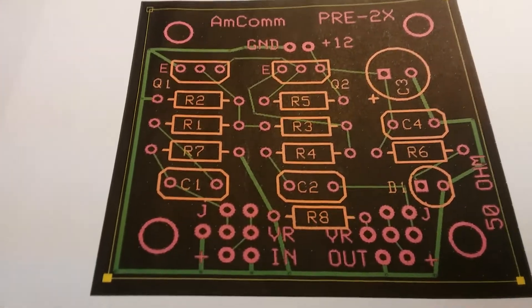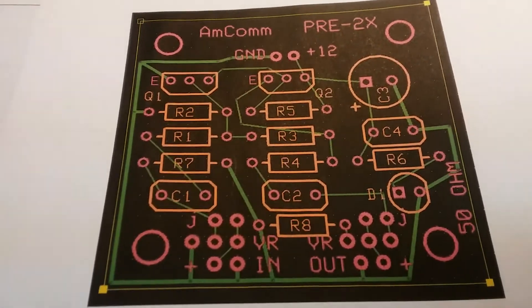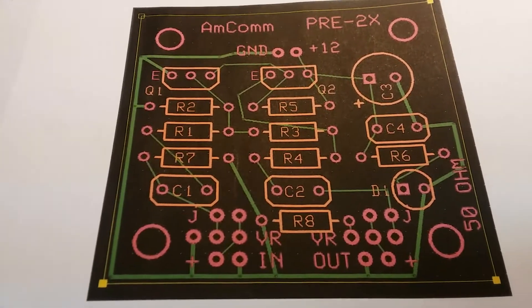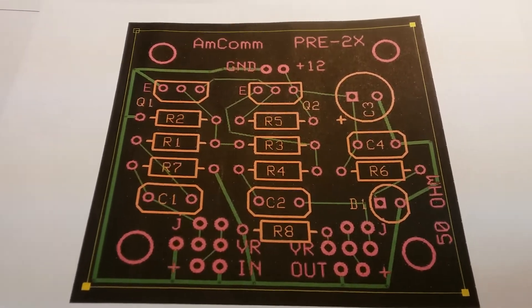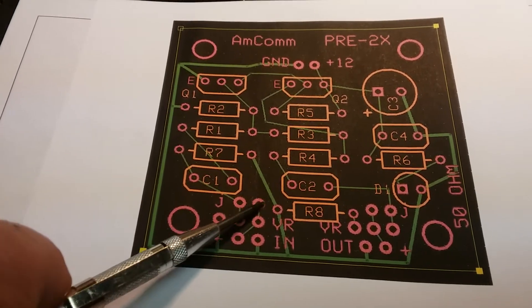You can wire the pots outside or do whatever you want. If you want to fix the gain at 15 dB, just put the jumper in with no pot, and you'll have 15 dB across the board. Then in your receiver you can switch it in or out as you like. This is the component-side view with green showing the circuit side and the parts layout.